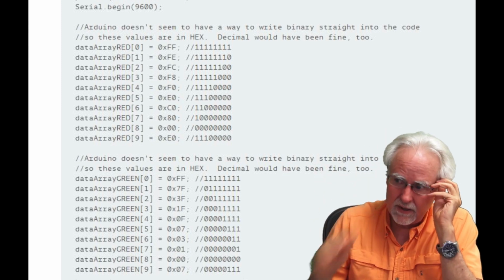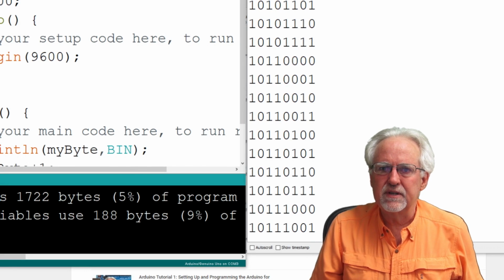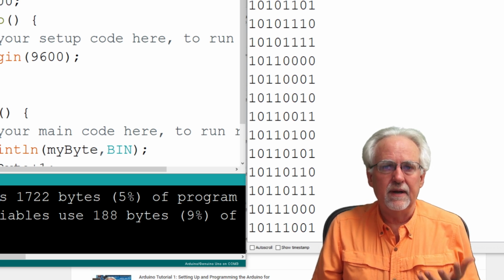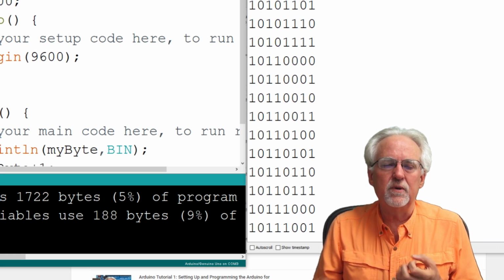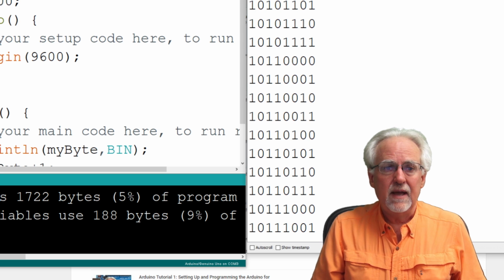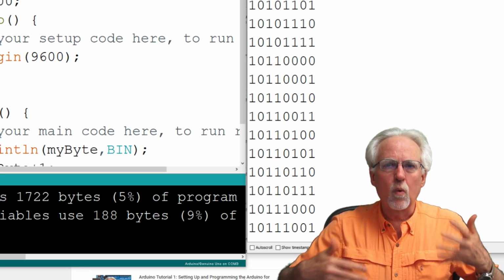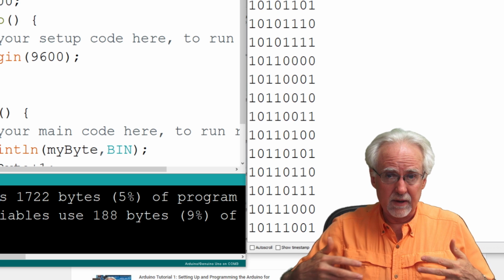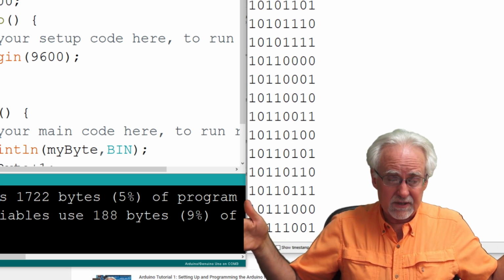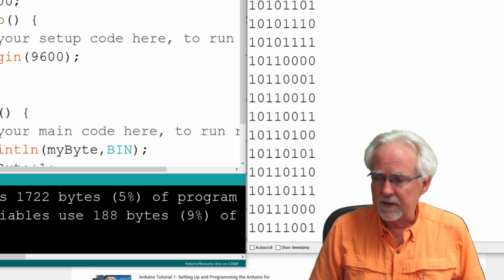Well, it would be easier in binary, because if we look at this example that we were just on, 1010, that would be on, off, and that would simply be an A. And then this would be on, off, on. And so I could get the LEDs the way I wanted to, and I could configure them. For this case, I would simply keep track of the number AB. A is 1010, and B is 1011. So you see, if we're working with things like LEDs that we're turning on and off, or different things that are lined up that can be on or off, it's easiest to keep track of them in binary and then to group that binary together into hexadecimal.